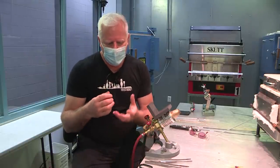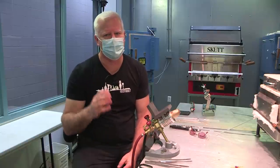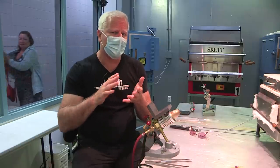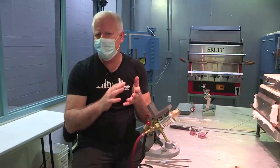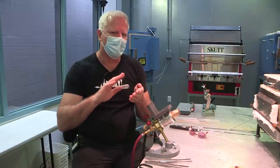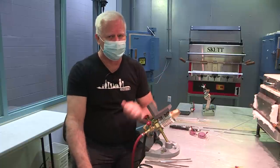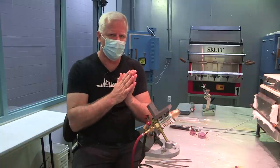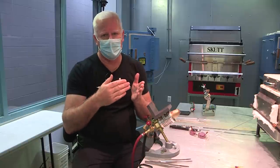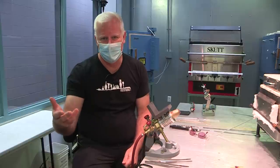To manipulate the glass and the silver within the glass, we are going to use an oxidizing flame, high oxygen levels. And what that's going to do is it's going to start to dissolve the silver crystals. And what you'll see on the surface of the glass is this metallic haze. It'll look like a fog. We're getting the glass to go to a transparent level, so we're going to need to burn off that haze. We're going to manipulate it slightly, and then we're going to let it cool. And as it cools, what happens is we start to develop this spectrum of color. And the spectrum starts from clear, works to yellow, orange, red, purple, blue, and then green.